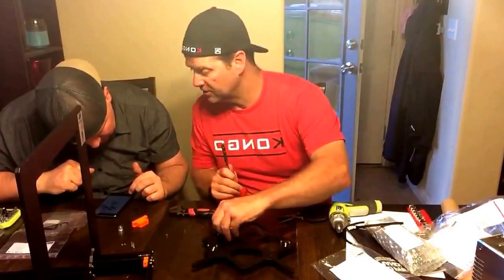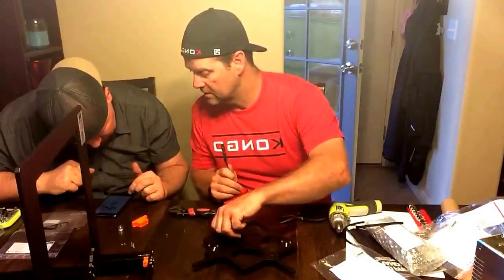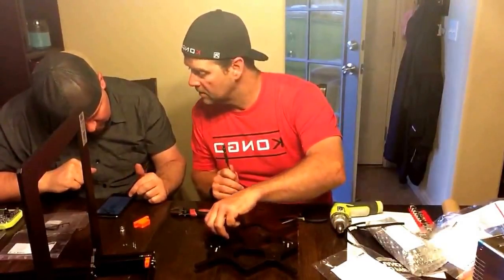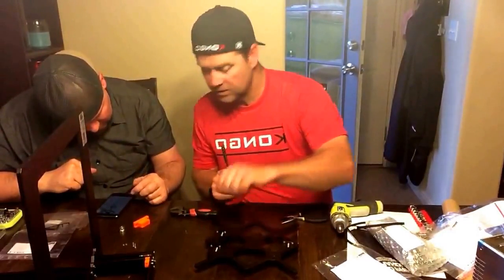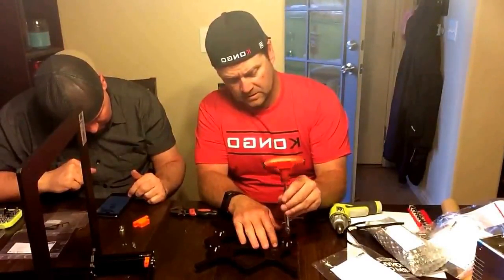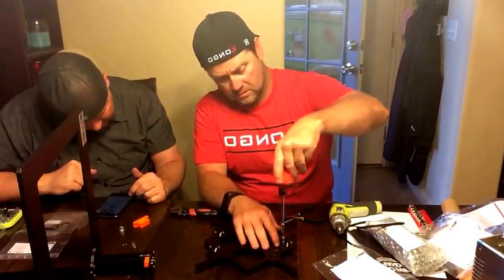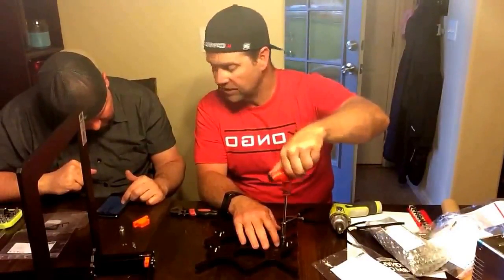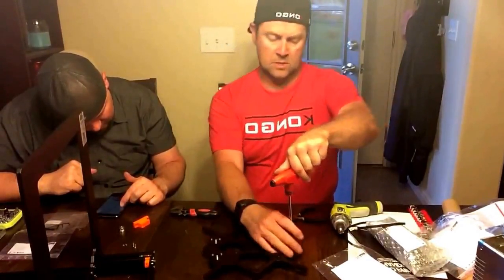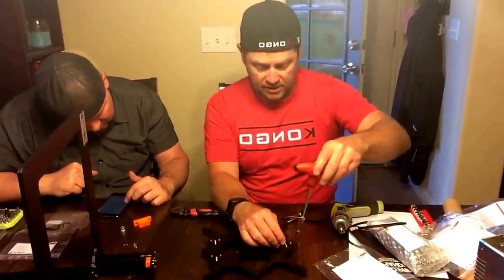Looks like they're doing it with needle nose pliers. What's 90 degrees? I don't know, let's see. Check bearings, just to the surface. When you're ready to use pliers, rotate each nut about 90 degrees. That's cinching it down. Yeah, they just don't want you to over cinch them. You could use the needle nose. They just take them to the surface and then go to a 90 degree.